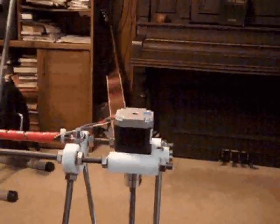The Y-axis motor is hidden right here between the rails — pretty neat that it came out like that. On X and Y I have 270 ounce-inch motors currently. This is a 425 ounce-inch on Z. Notice the difference in size between this motor and the NEMA 17 motors on my RepRap printer.